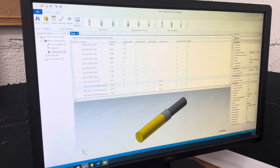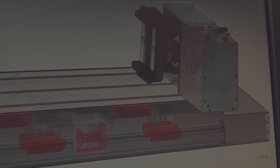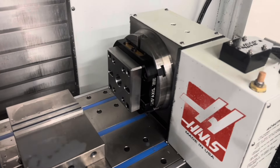So when they're doing their modeling and programming, they know exactly what the shape is and what the cut's going to look like in the part. They're also importing the models for the mill, the fourth axis, and all the jaws. This helps them visualize, make sure they don't have any clearance issues, and avoid any accidents. You can see it matches the actual setup that we have.